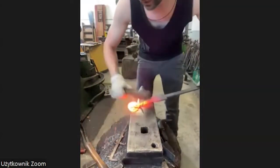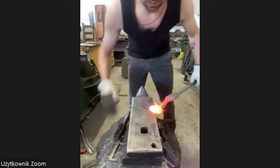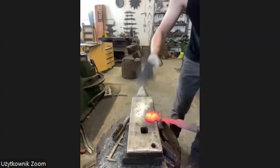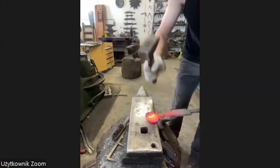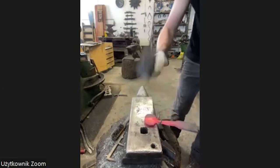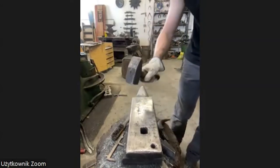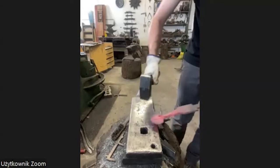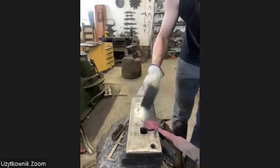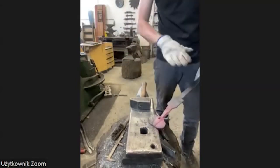Okay. I'm going for the ears. I'm going to use my hammer like this to put the material to the side. I try to remove the material, not the hammer. Pick one place, and the hammer is bouncing. I'm not using a lot of energy. I just let the hammer bounce because it's very thin material, and you don't have to push it to the edge. Let it flow. Because actually the material is floating, like cream.